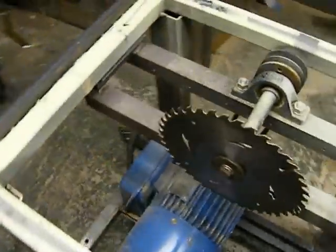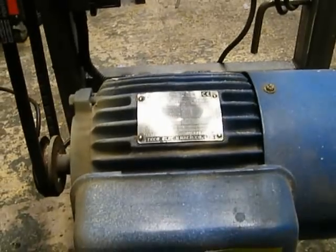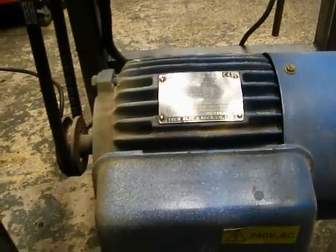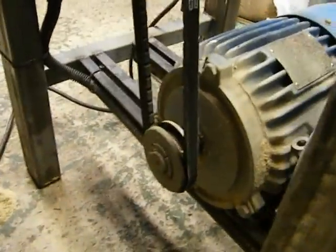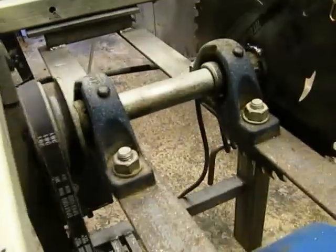Let's take you around to the motor. Got the largest one I can run off single-phase — three horsepower, 2.2 kilowatt, 2800 RPM, capacitor start, capacitor run. Pretty powerful, pulling out about seven kilowatt on start-up, but it runs everything I want to do.